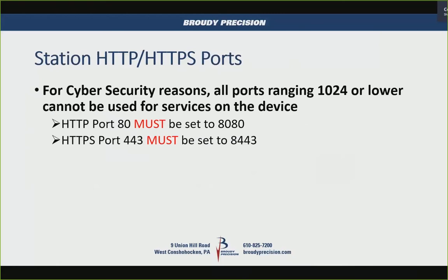You may want to create a base station template for the Eagle Hawk with all these types of changes already made, so you don't forget them on each job. Regarding email service — that's an outgoing port, which is different. This HTTP/HTTPS restriction is for the servers running on the controller — for browser access, not outgoing services.